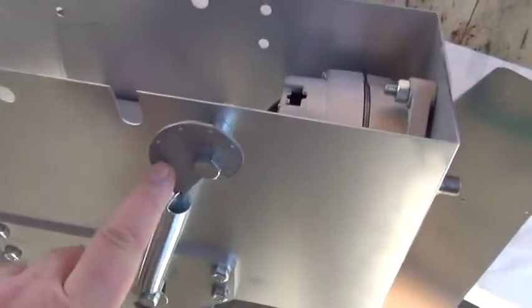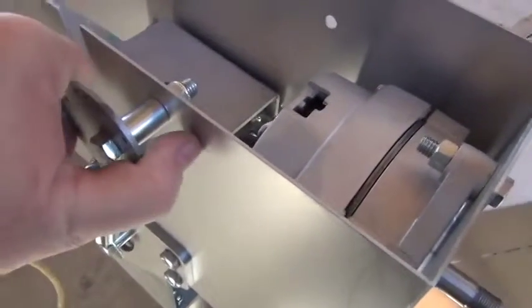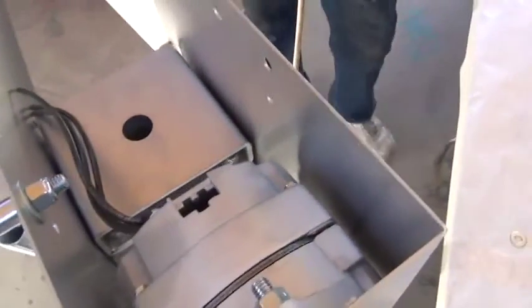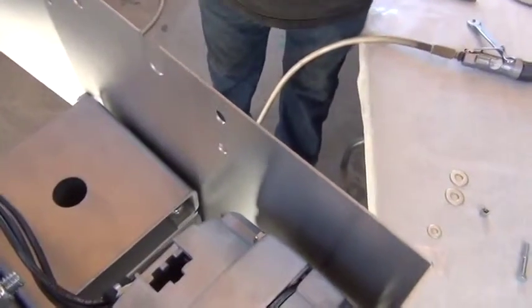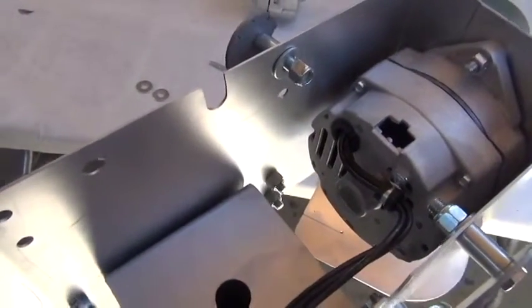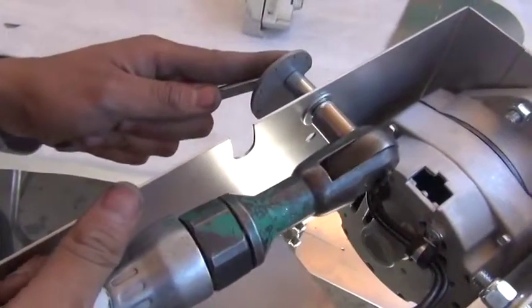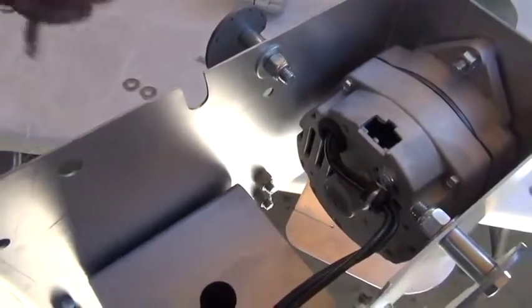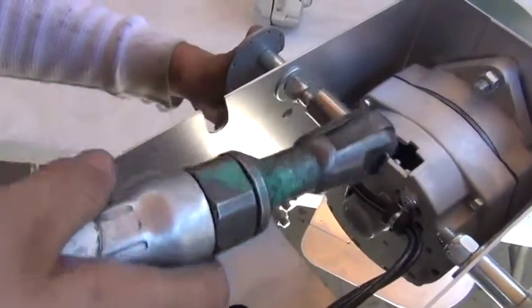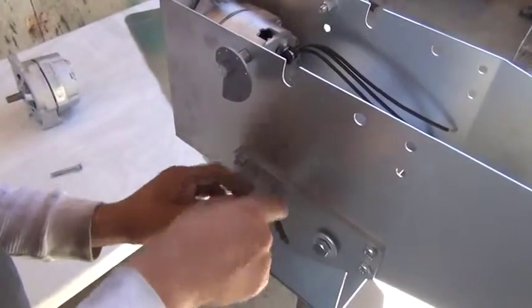All these different positions are for tighter spring tensions — you would just rotate this whole cam around and choose holes. Like if you choose this hole, it would obviously be down here at the bottom somewhere, so this whole thing would rotate. We're going to put in the other spring and another cam. Make sure you put a washer back here — it's very important.